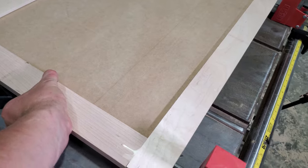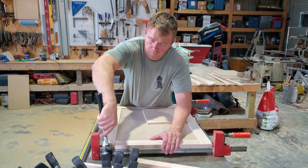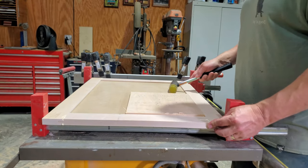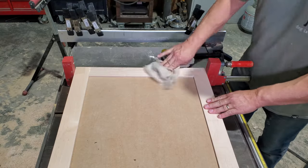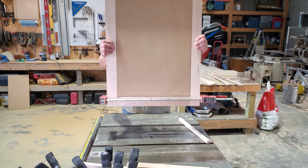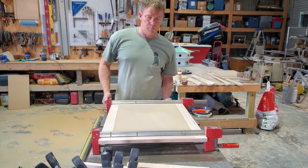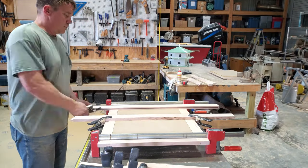I'm kind of checking everything over and applying a little bit of clamping tension, then knocking all the parts so that they're perfectly flush. The rabbet I had cut was just slightly not the right size, so I was using these spring clamps and boards to make sure that the front of the panel was glued up in the right plane.